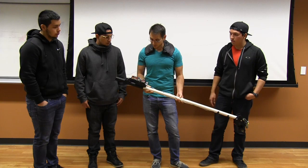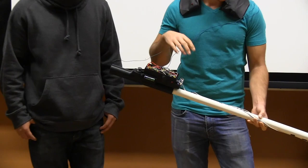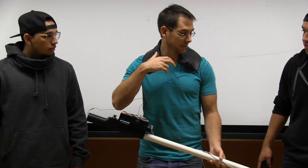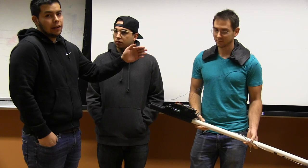We have a 9-volt battery in our chassis powering the Arduino and our sensors, and a 6-volt rechargeable battery to power the servo. In the headset, we have a PIC controlling the vibration motors, the speakers, and LEDs. We also have an LCD screen on the back, again for testing, to ensure we are receiving the proper signal. Based on whether the left or right sensors are triggered, a high left or right will be displayed on the LCD.